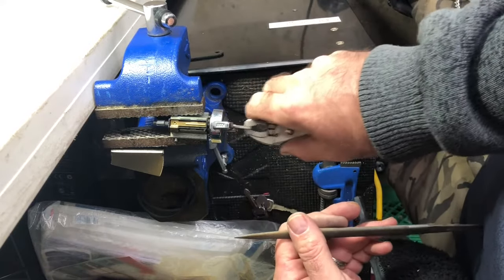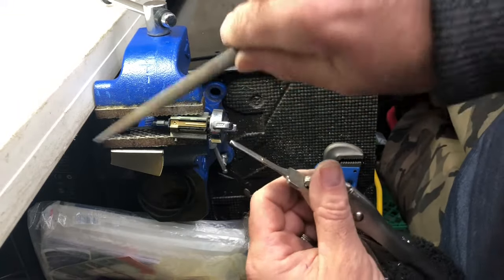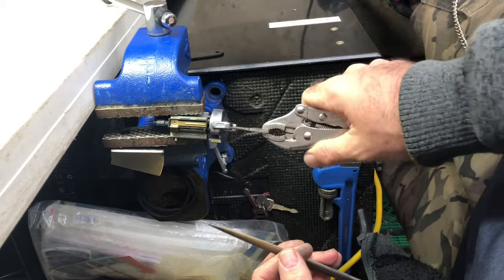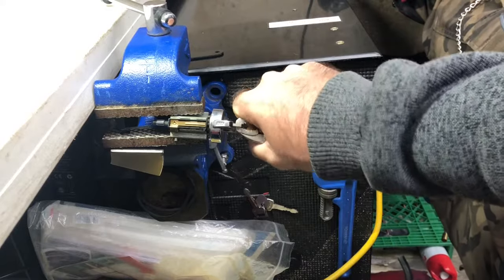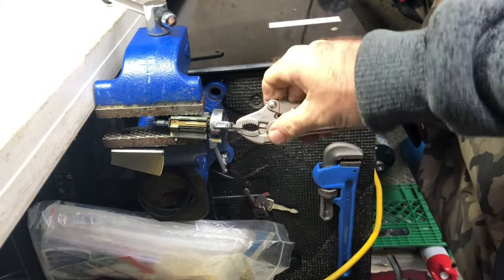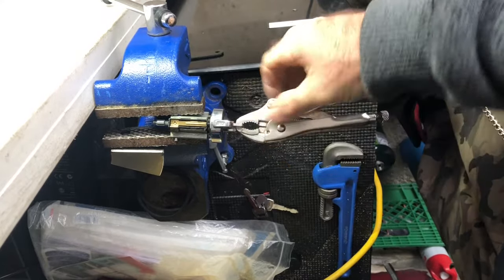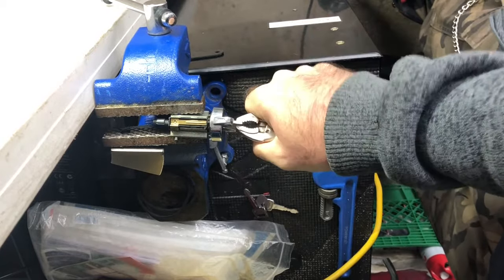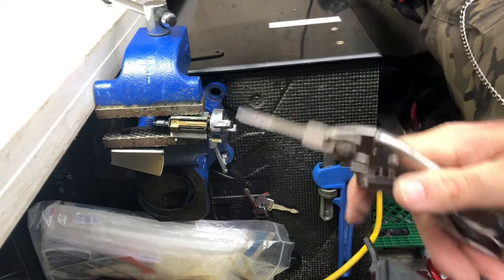If you have to jam it in, you better take your key out, clean it up, and make it all nice and flat and smooth. Put your key in the lock, then put some slight pressure on it and wiggle it up and down, take the pressure off, then some more pressure on it, wiggle the key up and down, take the pressure off. Do this a few times — wiggle it, make sure it's not binding anywhere.